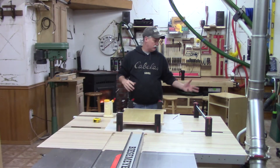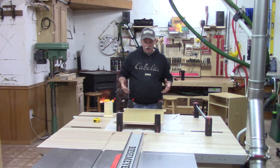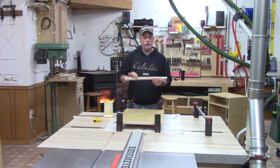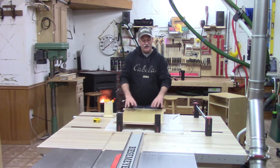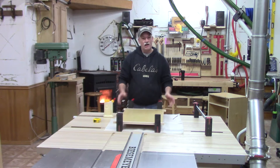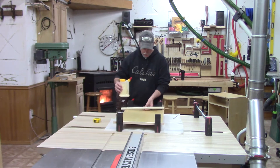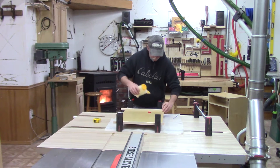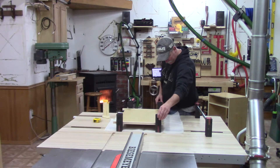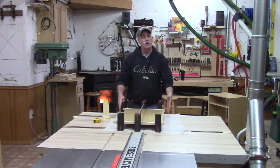This cart is going to have a double bottom on it to give a little more girth in the bottom plus support the wheels a little bit better. I didn't want the edges of the plywood to show, so I went ahead off camera and milled up some three-quarter by half-inch stock. I cut the secondary bottom an inch shorter and we're just going to go ahead and glue these on, let them set aside to dry while we get after some other stuff.